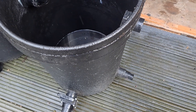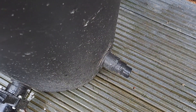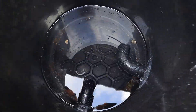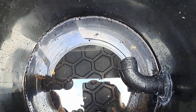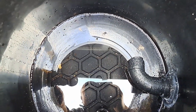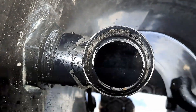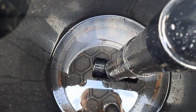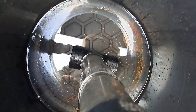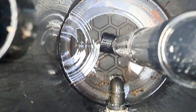The homemade filters are just about finished. Water goes in there, comes out the pipe, and is flushed around inside like a vortex. It then comes up and goes through this two-inch pipe into here, which drops all the way down to the bottom. There's a T-junction at the bottom, again causing a vortex around the inside of the bin.